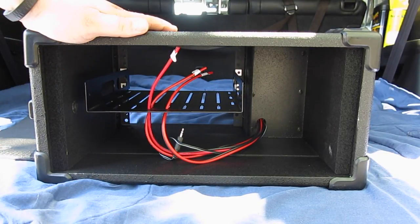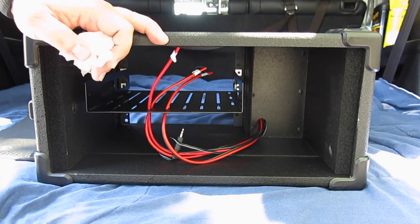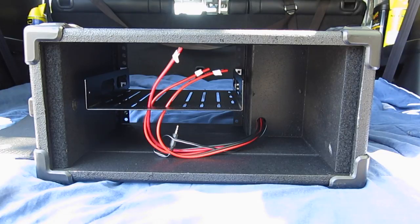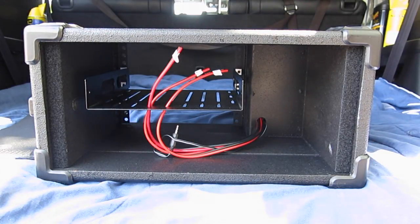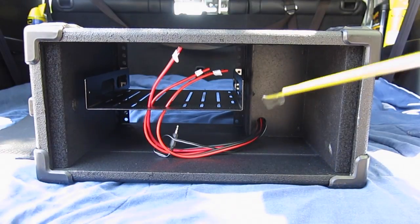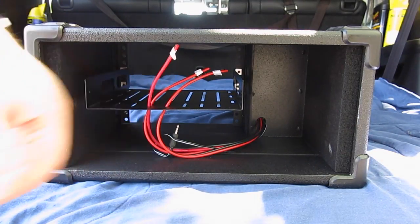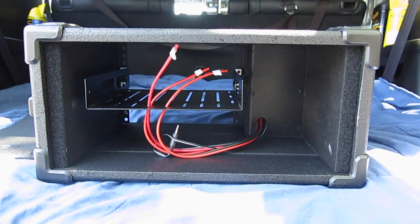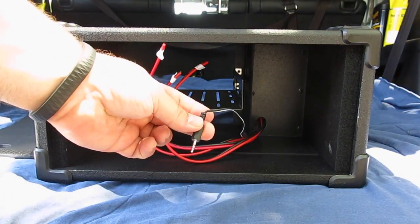One thing I believe has changed from the original version is that the original had a panel that came all the way back and cordoned off a section, which is one reason I worried it wouldn't be big enough for my applications. But as you can see, you actually have all the space sideways — so for larger radios like an Icom 7100 or a Kenwood TS-480, you can turn the RF deck sideways and have it fit. Safely you've got about seven inches of space until you hit the back of the distribution block, and about 14.5 inches of total usable width back here. The space between the rack side and the wall side is almost exactly the same width as one of the small Powerwerx switching power supplies.